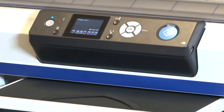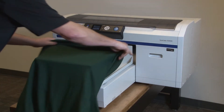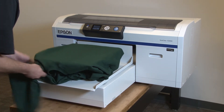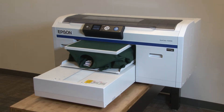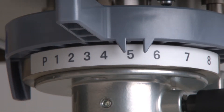At position three the shirt and collar pass the height test and I can image my shirt. The actual numbers are relative to the garment in use and how it's loaded. If I sleeve a heavy sweatshirt on the platen by placing only one side of the garment on top, the first setting to pass is a four. This makes sense as the sweatshirt is thicker than a tee. So for this sweatshirt garment, a platen height setting of four or five is appropriate.